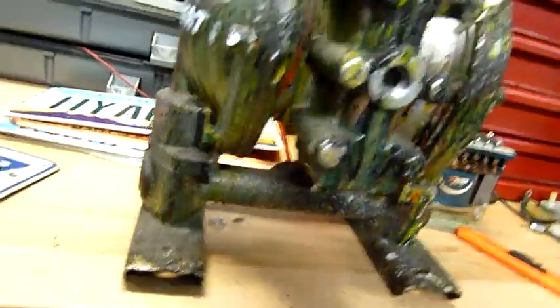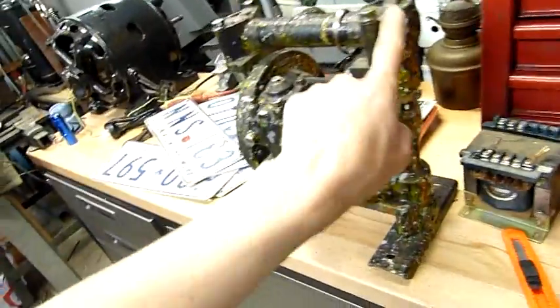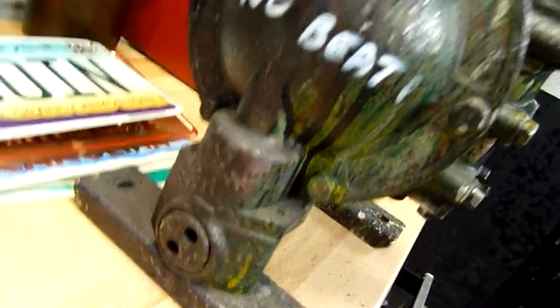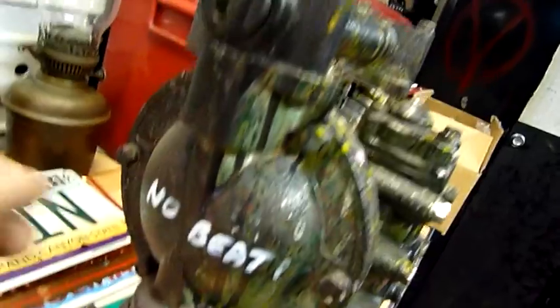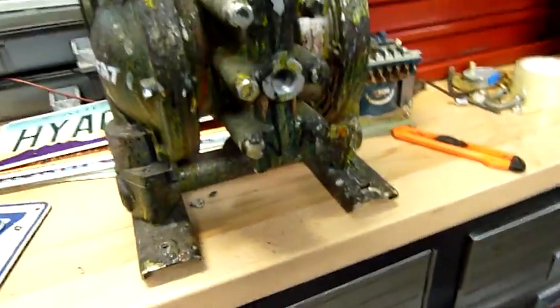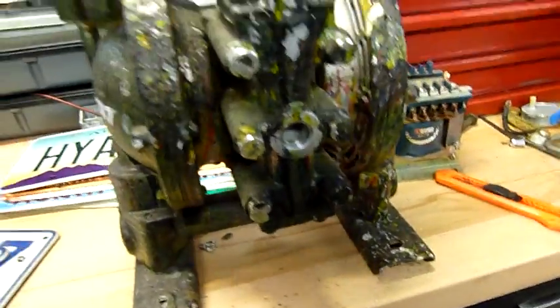That would just go off somewhere else to keep it quiet. And the inlet and outlet are here — one side will be inlet valves, one side will be outlet. Won't be hard to figure out. Probably even marked somewhere on here, assuming it's not covered in paint. I'll be willing to guess that the inlet will be at the top for gravity priming and then outlet will be at the bottom. So anyway, I'll give this a bit of an examination and first I'll just apply some air pressure to it and see what it does.